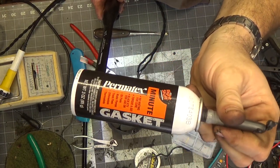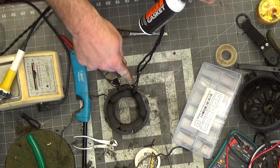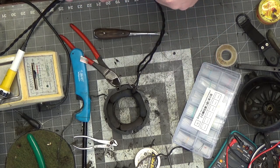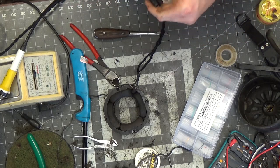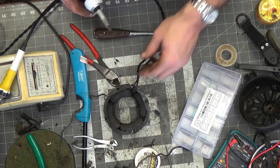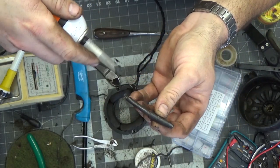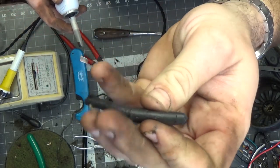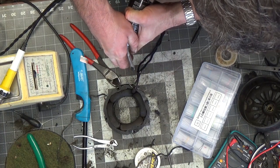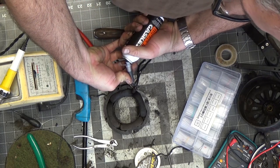What I'm going to use is called 'The Right Stuff' — it's really good gasket material; it's expensive but it works. I'm going to use it to create a potted gasket here that will protect and insulate the connections. They also have liquid electrical tape, which works pretty good, but this stuff has great elasticity — you can actually draw a gasket and let it set hard. You could draw an O-ring with this and it'd be perfect.